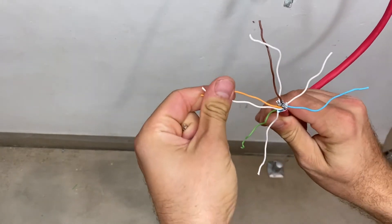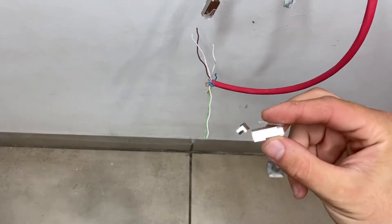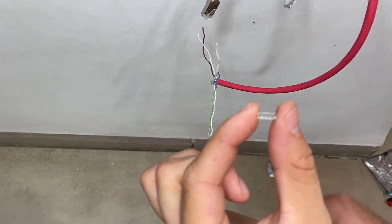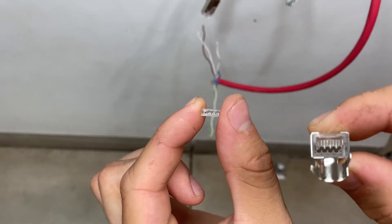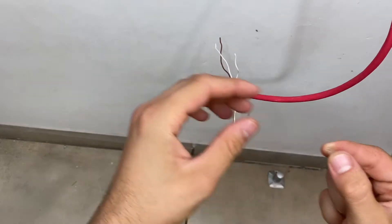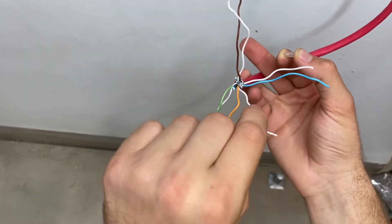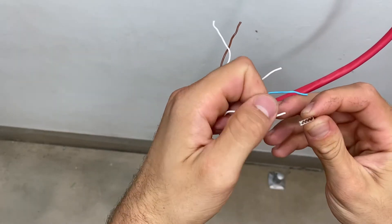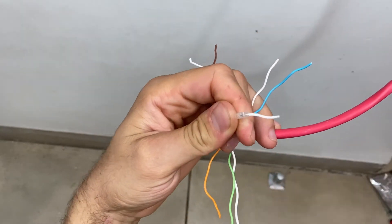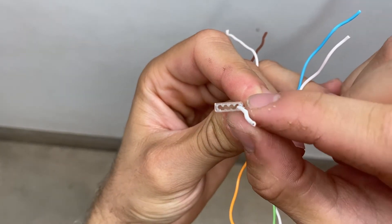Let's start from the beginning. Take a new red cable and separate them into two couples by each color. This is the second type of RJ45 connector I will show you in this video. On this connector you will need a presser tool to close the cable. This little plastic piece is the bridge that comes with the RJ45 connector — it will only come if you install a Cat 7 cable. In Cat 5 or Cat 6 you won't see this bridge. Take your bridge and start with the orange cables. Take the white-orange cable and insert it into the bridge.